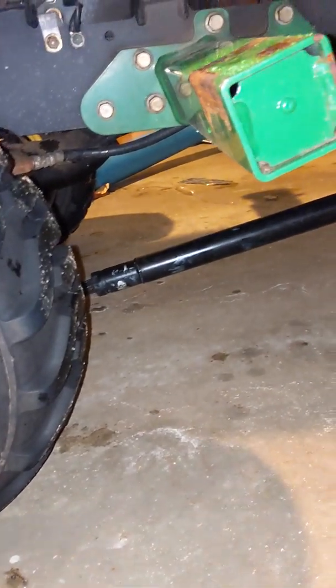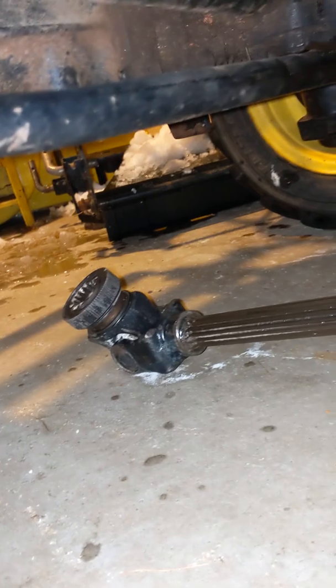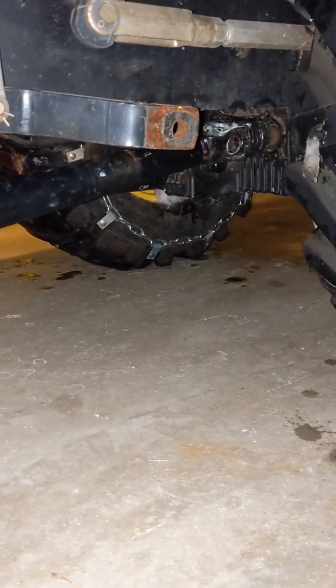This is the original shaft, and if you watched it while it was spinning there was a huge amount of play — you could actually move it with your hands. The trouble is there are two joints, one back there and one here, and neither one you can actually grease. I was reading on some forums and basically it's a pretty crappy design, and John Deere knows it's bad too.